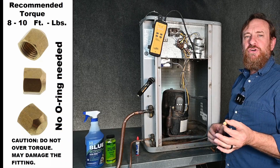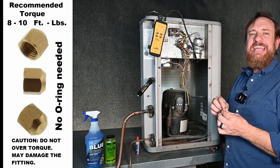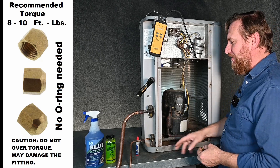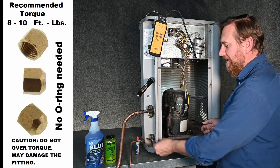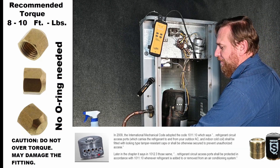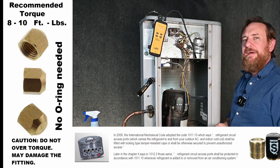The exception to this rule is if it has those hex head caps. If it has hex head caps, those don't have any kind of rubber O-ring, but I still like to use a type of nylog on there when putting them on because it's basically a flare-style fitting. When you put those caps on, you thread them in finger tight, then go ahead and take a wrench — they actually have a torque spec, and you can torque those back down.